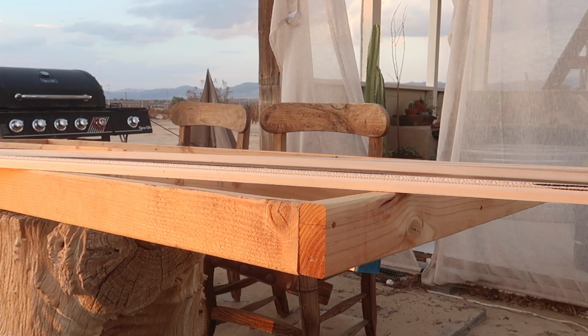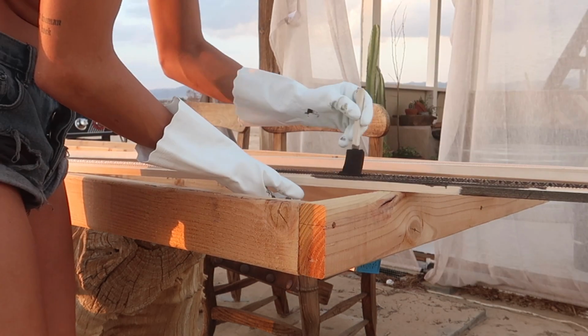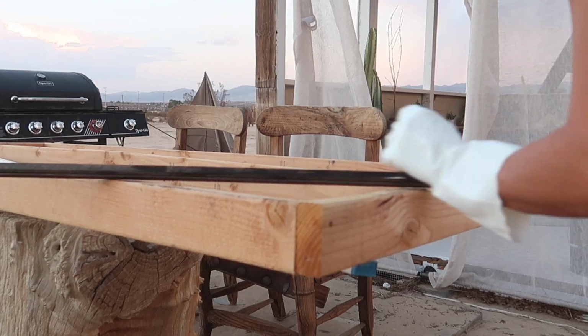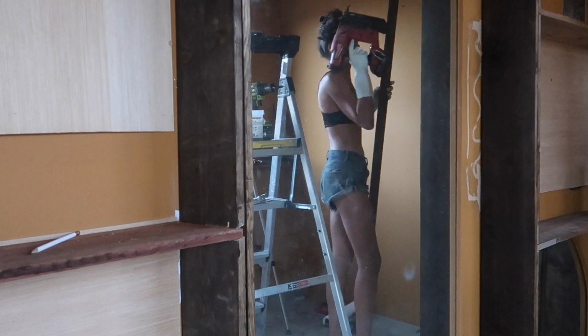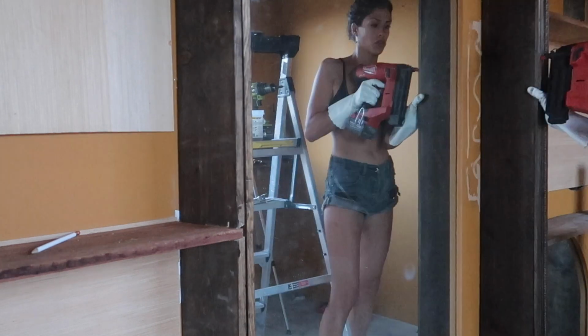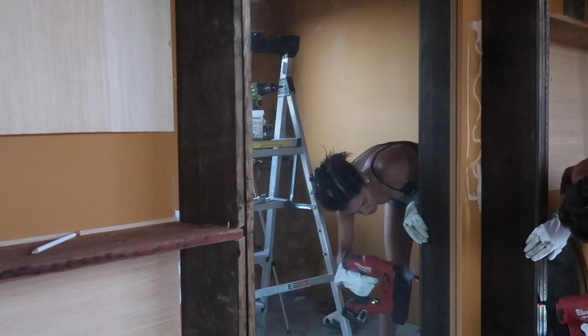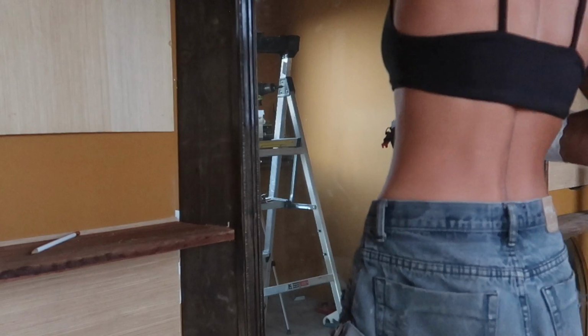To make that wood look thicker than it is and to really just fine tune this shelving situation, I went in with some decorative trim that I stained the Jacobean just like the spines, and I installed that with my nail gun. I have dishwashing gloves on because that's the only gloves I had for staining. I digress. I popped that trim onto the edge of each spine that was stained the Jacobean, not on the shelves, just on the spines.